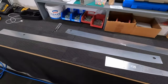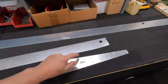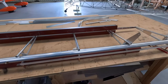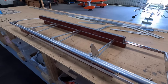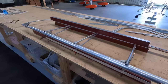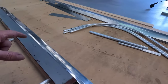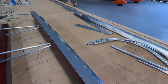All right, so in effect, I've made up a kit. All my parts cleaned up, cleaned off, still marked, make it easy on myself. The edge capping, ailerons blocked down, ready to go. I'll cleco it all again just to make sure it is all square, and then remove clecos and rivet, and we should have a nice straight aileron. I've got one little dent, must be on the other side, just in the trailing edge. I'll try and rub that out with a teaspoon or something.